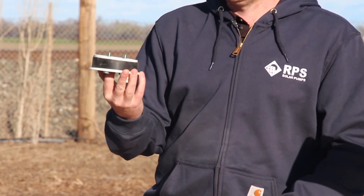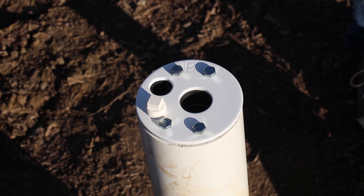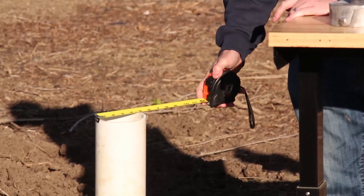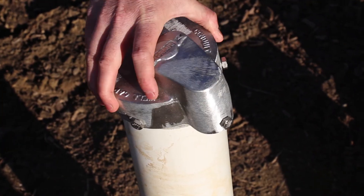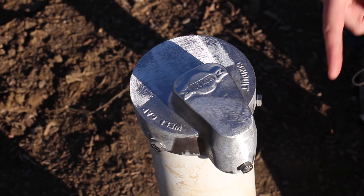This is super simple to install — the well seal simply slips onto the well casing and all other pipes go through it, both the drop pipe and the electrical conduit. If you're using a well cap, you can measure the inside diameter or the outside diameter. Here the outside diameter is four and a half inches, so in that case we want a four-inch well cap — it might also be called a four-and-a-half-inch well cap depending on who you're purchasing from. It slips over the outside of the pipe with screws to tighten it down, and electrical cables using a conduit can run up and down to the pump.